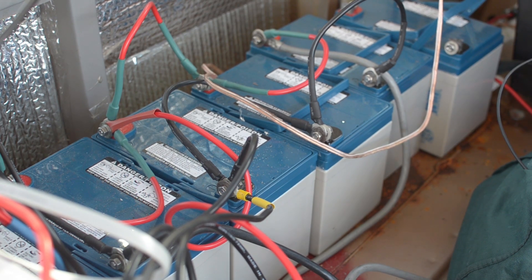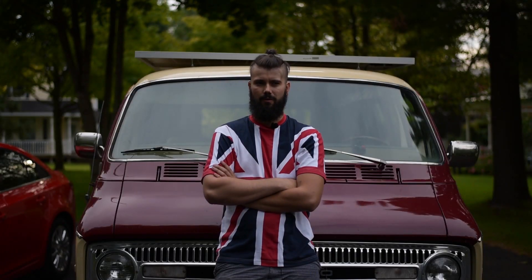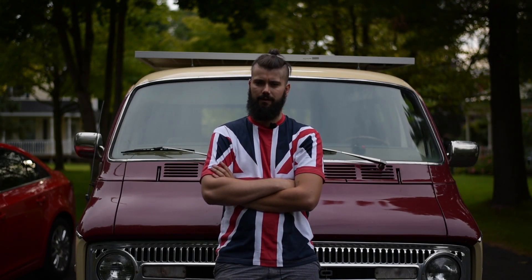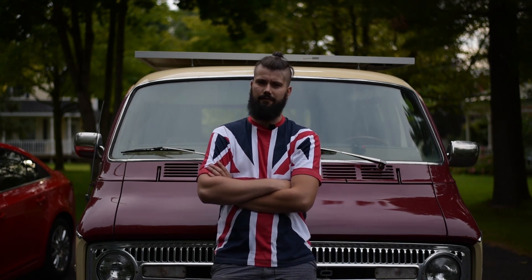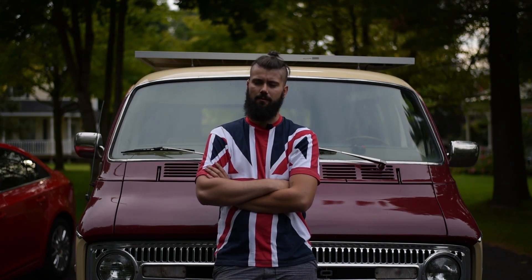The way I figure it, with my current projections, the system should last us two days' worth of power usage, and our solar panels seem to be able to charge the batteries from about a quarter or half full all the way to full in one day. So we're really happy with the amount of power we're getting, and as long as we don't have too many rainy days in a row, we don't think we'll ever have to constrain our power use.